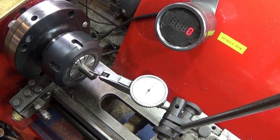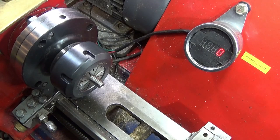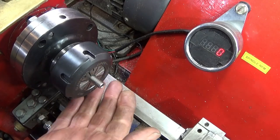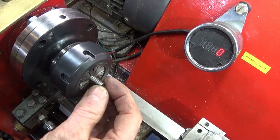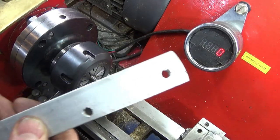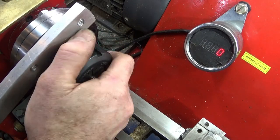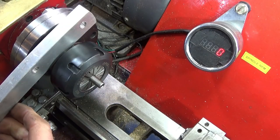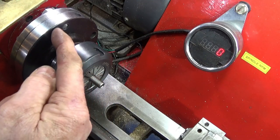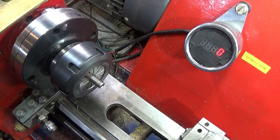So now I'm going to do a bit of turning with the ER40 collet chuck. I've got an 8mm grub screw held in the collet — this is something excellent for holding threaded parts. Having a collet chuck I'm just making up a handle to lock the spindle while I do the collet chuck up tight, so I'm turning down the ends so it won't mark the inside of the holes or the outside diameter of the ER40 collet chuck.